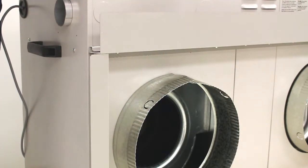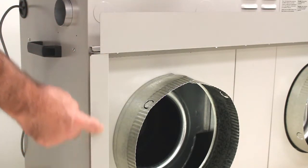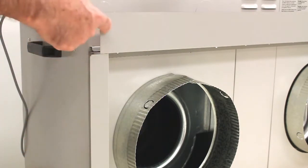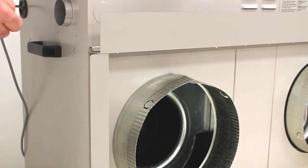Flashings are in place, and before they get pushed against the wall, we will need to look at putting some sealant down the side flashings and behind the top flashing. This is to seal it against the wall because we don't want any of that rainwater that's running down the wall running through behind the flashing and getting on our ducting.